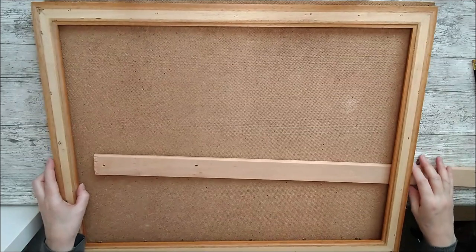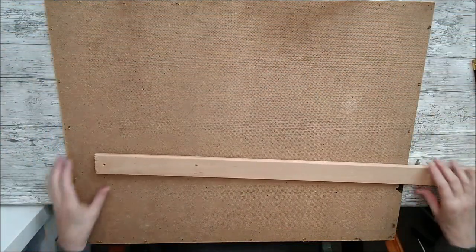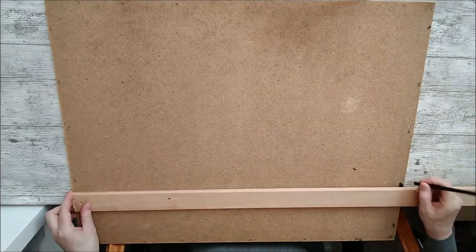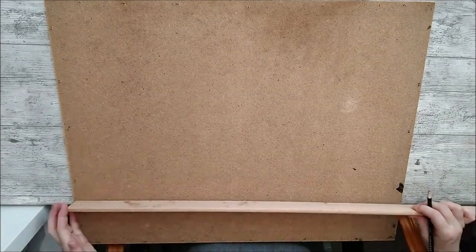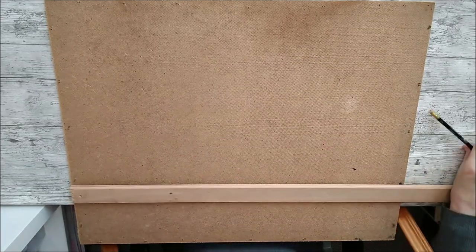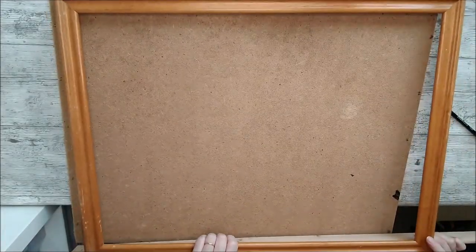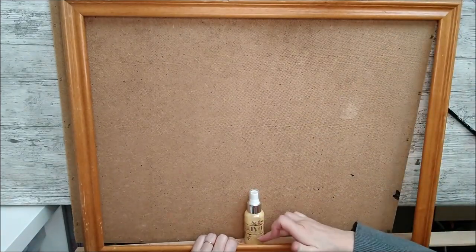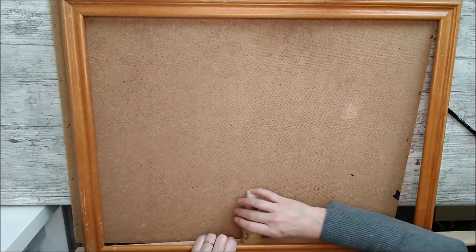But I've just decided now that actually it would be better if I cut the wood to measure across the way here and cut it off, just mark it exactly where that is there and cut it off, and have it right out at the edges the whole way around. Just butt the edges up, because it's not going to take any great weight. I don't need to mitre it or anything. But that means then that I'll have a little insert piece, but it means that that will be sitting right down to the edge, and some of these things then will be able to slot in here, and that will actually hold those bigger bottles in, and I'll actually get a little bit more space out of it. So I think we'll go with that plan.